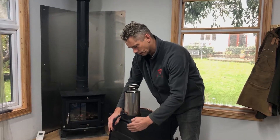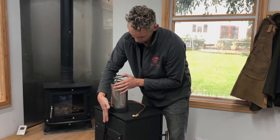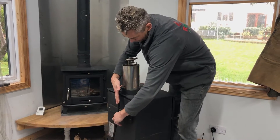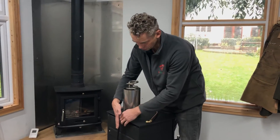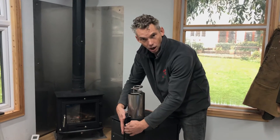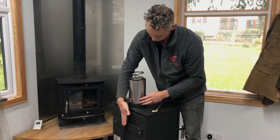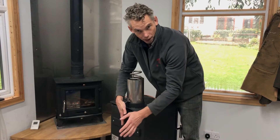But if you haven't got room to do that — for example, it's either been constrained so that the air can't turn into it, but more particularly if it's so tight that it's got to be touching the side, you can't do it. If it's just constrained, it will dry out if it can't get out of the direct high heat of the stove. But if it touches, then it can melt, and we've had a customer who's had that fitted right up against, and it's cut the line and melted it.